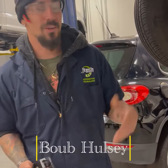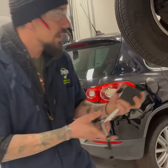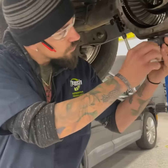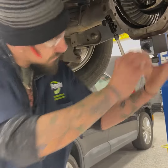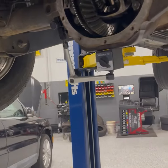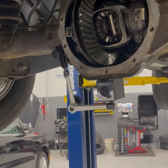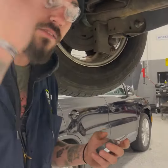Here's Bub at JTEC. Today we're going to work on the ring gear runout. First thing I'm going to do is go ahead and get our dial set up so we can get that runout. The runout that we're looking for on this vehicle is anywhere from six to ten thousandths of an inch.